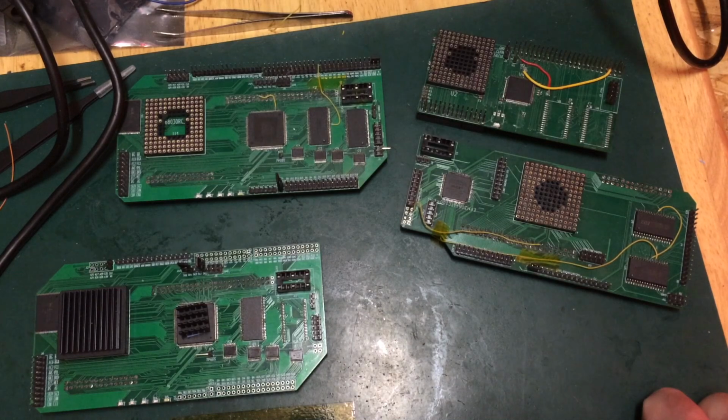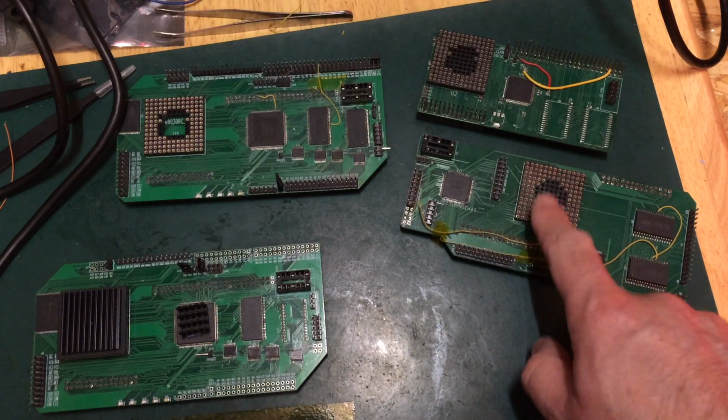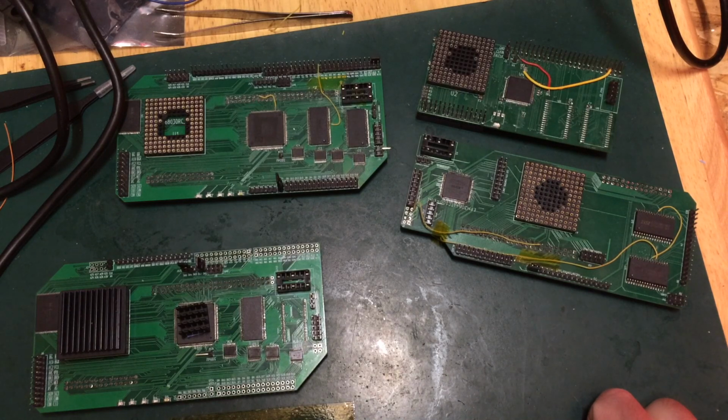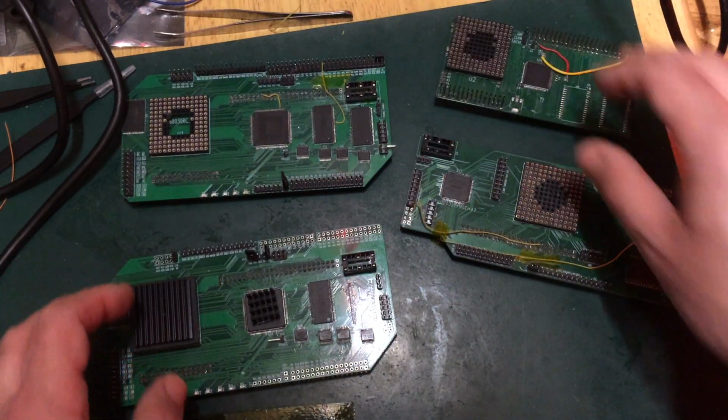I decided to take a step sideways and try a design with a quad flat pack chip instead of the PGA, because I found the PGA very troublesome. But the quad flat pack chip doesn't run as fast, and it was an absolute beggar to solder. And I went and got my footprint wrong, so it was completely useless. So this was the next one. This is the DFB1r3.